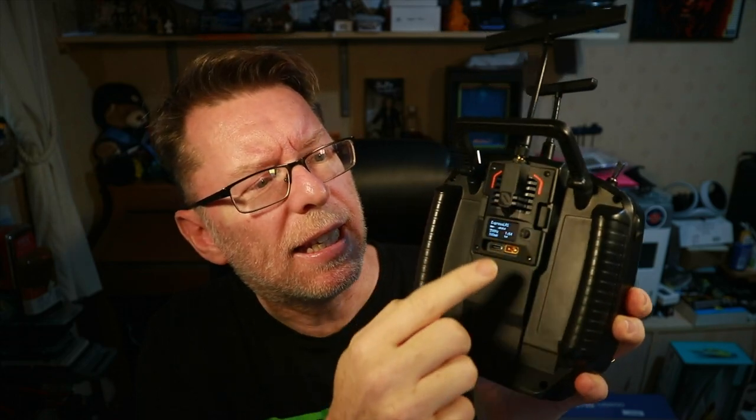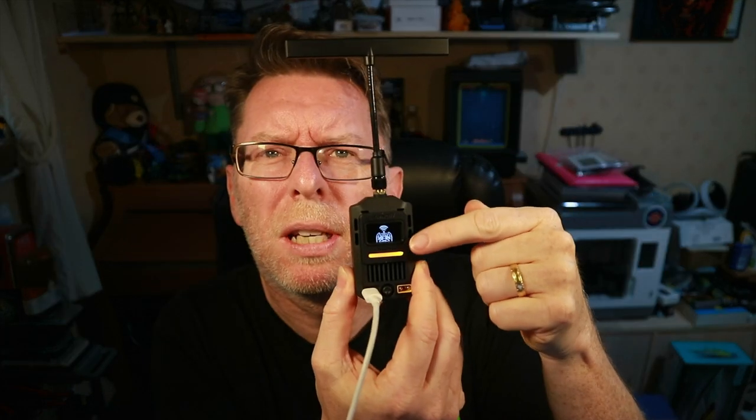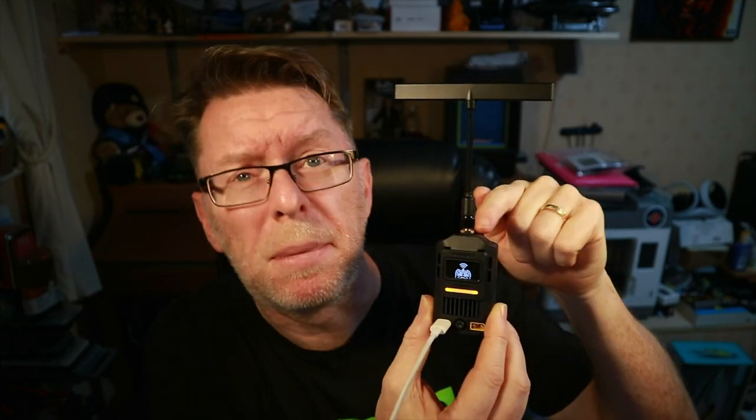You'll notice it's got a nice little LED, and even though these are the smaller non-all-singing modules, they have got a little OLED display with a five-position joystick - that's an upgrade from the Ranger module. The nano module will fit things like the Zorro or whatever's got a nano bay. Aside from plugging into a bay, it's got a little XT-30 socket which takes 6V to 16.8V - so a direct 4S battery. There's also a USB-C port for powering up and doing updates, though you can also update via Wi-Fi.